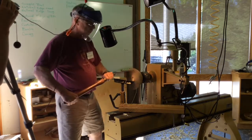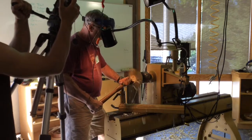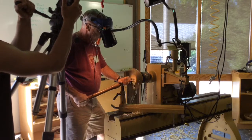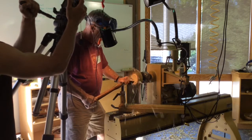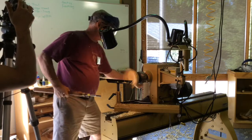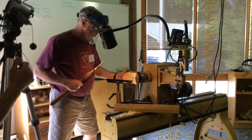We're starting in the middle. Starting in the middle, working our way to the outside. Nice little bowl cut. This wall I'm leaving in front of me, if I jam this tool in there, it's going to grab and tear things up. So I've got to make sure I stop ahead of where this wall is that's in front of me. But you can start to see the wings taking shape there. So now it's just a matter of continuing down.